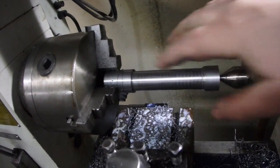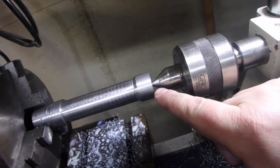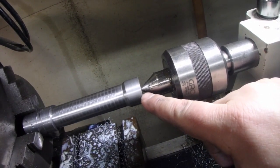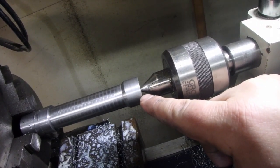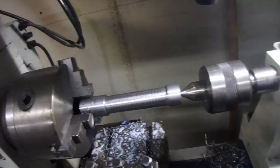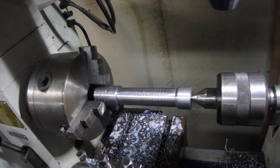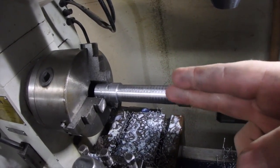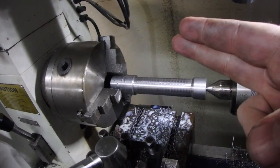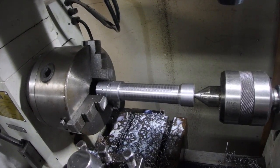After machining I kind of like the profile where it's going. We're going to taper this end off — I think this end will be where I have the ORB fitting, so we're going to have to drill a hole through there, tap it, make sure it fits. Once we get that done we can flip it around, start working on the back side. Actually, we won't drill the hole yet — we'll make the piston first and then accommodate the hole for it, probably around 3/8 or so.